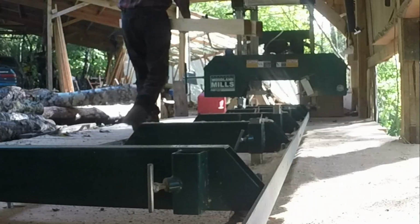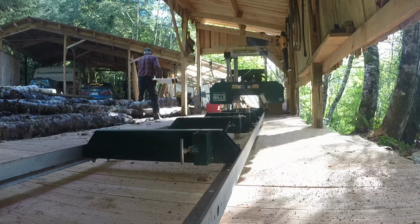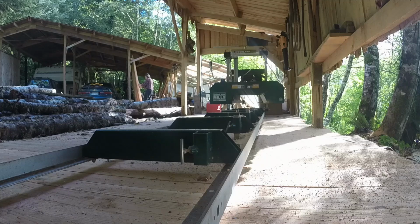Lumber should be stored flat on stickers to allow airflow in and around while they dry. This wood is not green though. It's wet from lying in the marsh, but it's not green. I don't have enough flat space to build proper stacks, so I'm standing it on end in the shed out of the rain. I'll deal with proper storage later.